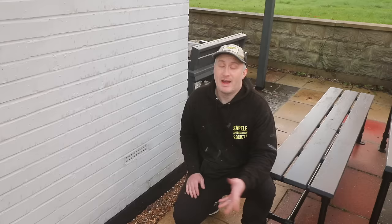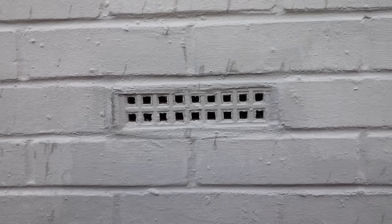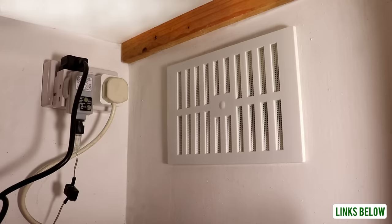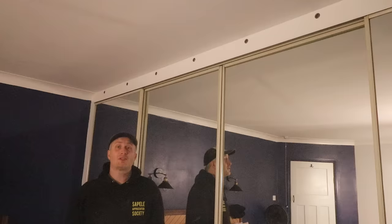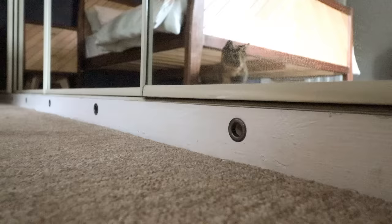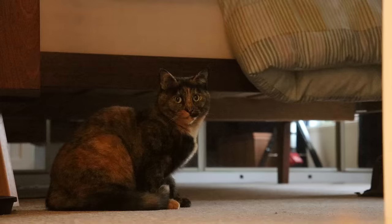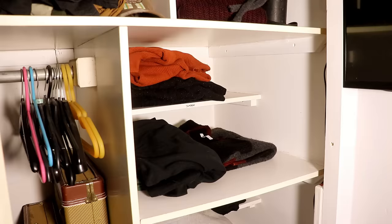So this brings me on to the second thing I did which was to install a couple of air bricks in the walls to allow fresh air into the wardrobe. It wasn't a difficult job — I just used an SDS drill to drill out the mortar around a brick on the outer skin of the wall and then installed the air brick with some fresh mortar around it, and then on the inner skin of the wall I drilled a series of holes to allow the air to flow in and covered it up with a plastic hit-and-miss vent on the inside wall. I also drilled a series of holes with a spade bit through the top and bottom rails that hold the sliding wardrobe doors and inserted some metal eyelets into the holes, again just allowing more airflow into and out of the wardrobe. We spent a great deal of time thoroughly cleaning all the mould off the walls using a mould and mildew remover spray and then repainted all the inside walls with a mould resistant paint — I'll leave links to all of the products we used in the description box. Then eventually we were able to store all our clothes in here and now three years on it's still looking as clean and dry as when we first dealt with the problem.